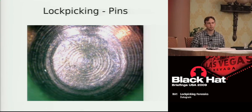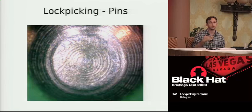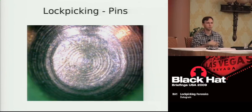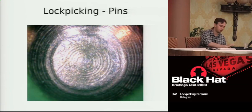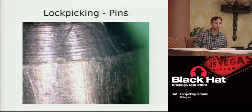It's just a very hard thing to invasively manipulate with a steel tool, and hopefully we'll have time later to look at anti-forensics. Every material I've tried to do it with hasn't worked, or it's left evidence in some other form. I tried fiberglass. Fiberglass left very few marks on some of the pins, but it left fiberglass dust all over the lock. I tried carbon fiber, but carbon fiber made pretty similar marks. I've tried brass, because everybody says, well, a key's brass, so maybe a pick made of brass wouldn't leave marks. I've tried everything that I've been able to manufacture, and everything leaves marks. I don't have time to go over all of them in the talk, but if you look at the website later on, you can see all the various things I've tried, as well as the microscopy from the examination of them.